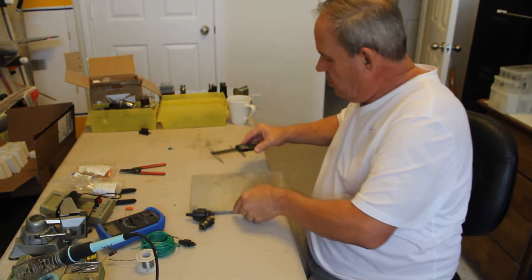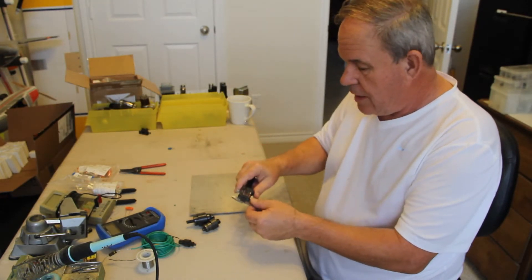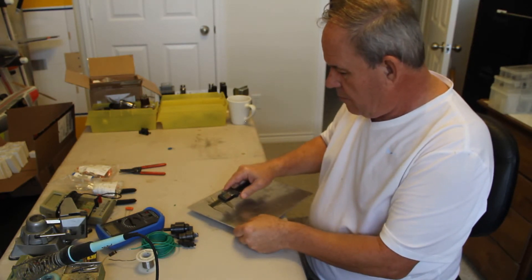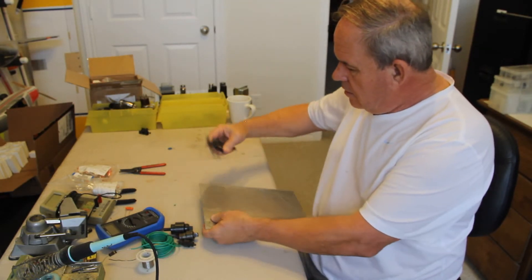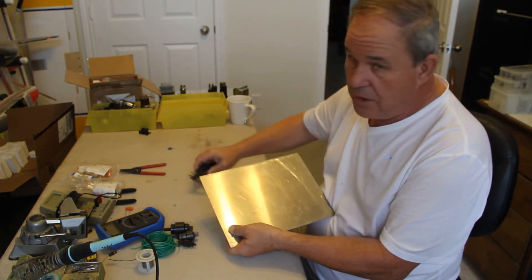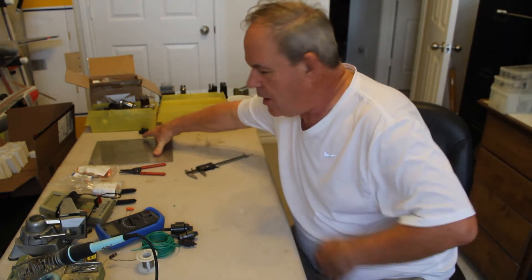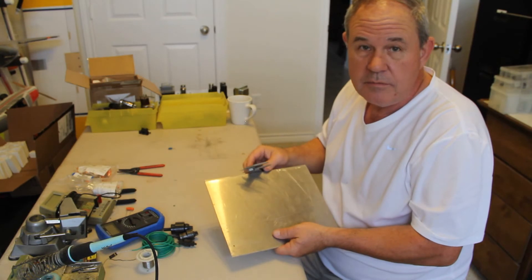I'll show you a quick trick here on my levels, but I'm just going to go ahead and talk about it. Some $9 on sale Harbor Freight digital calipers — I've used these things. I have a few pair of dial calipers, but these are pretty cool. I have my ruler out and my scriber and all that. I got a one inch line — I just made a cross line for one inch out of this corner. If I want to mount all my pots down there in a straight line, there's my straight line. Anybody who uses calipers for scribers — we're talking about sheet metal scribing. These are calipers as a scriber. It's a real handy trick.